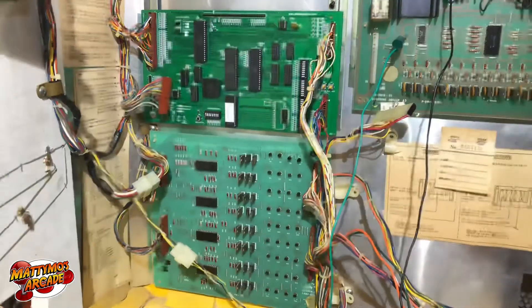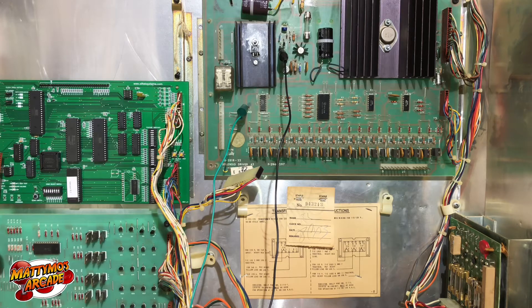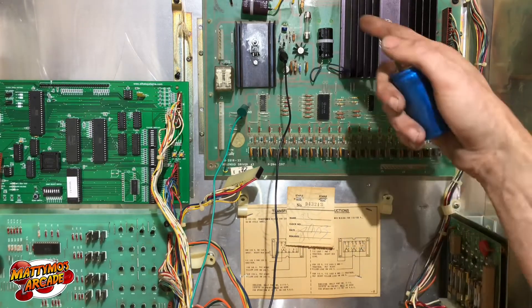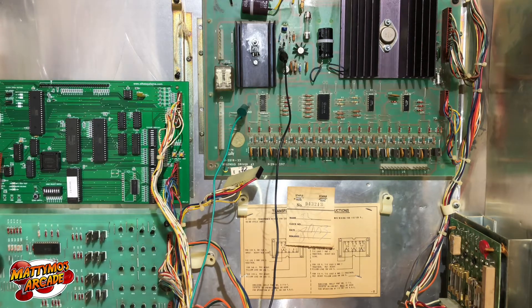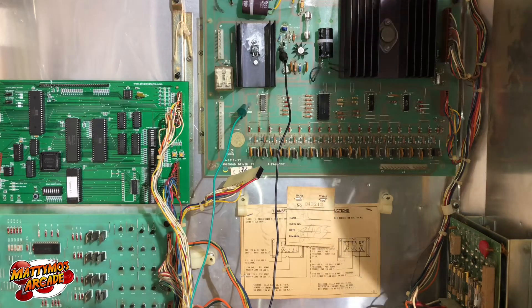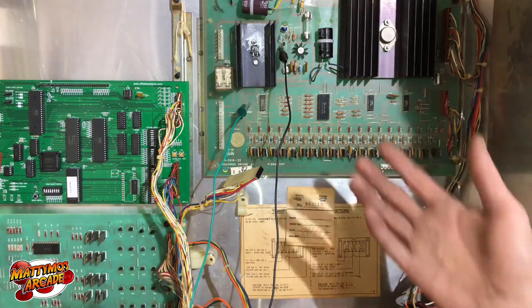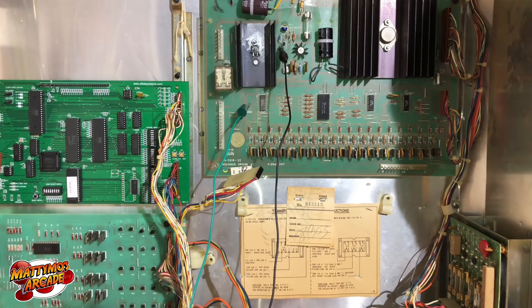The problem really was that even though that part tested good, I took it as original where I should have pulled it and verified it was the correct part after having a problem. When your voltages match, there's a problem; if voltage is high, that's another problem; if it's really low, the diode is bad. The most important thing is: replacing parts isn't actually fixing the problem that caused those parts to go bad. You have to look at the circuit and either upgrade something or replace something earlier in the circuit that caused the failure down the line.